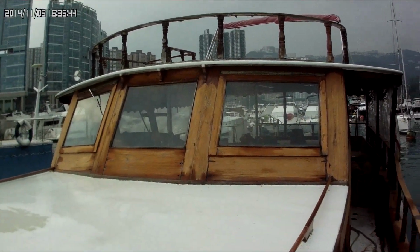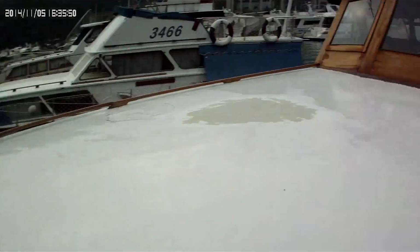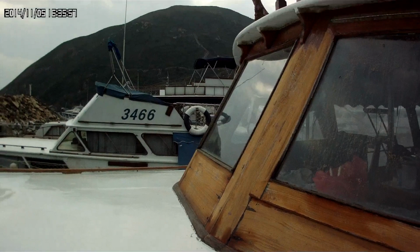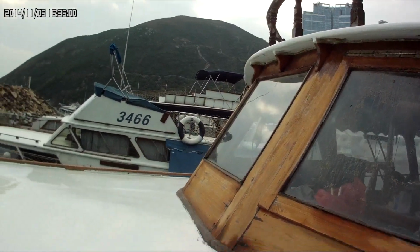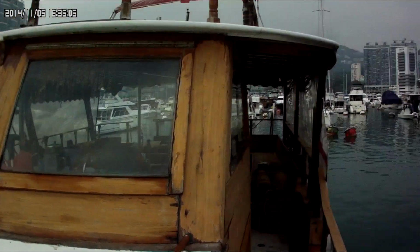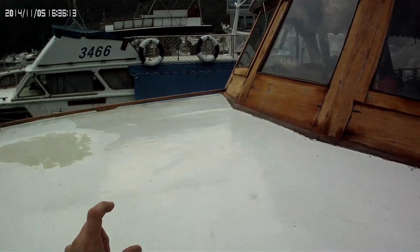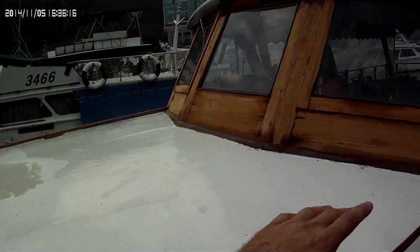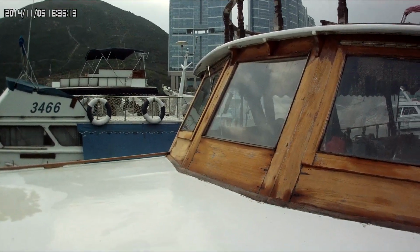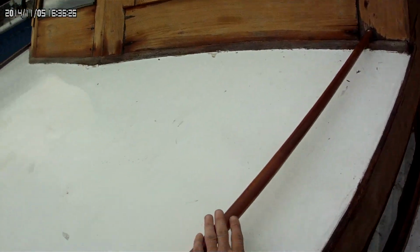I've got to get three coats. That's three days, so Friday, Saturday, Sunday. It's cutting it close, because the solar panels, I'll have to bring them over. They're going to be running pretty close, right up to here. So varnishing here is going to be a pain in the butt. We'll see. My goal is Sunday to have solar panels up, or at least here. Maybe if I don't attach them there, because I've got the feet for them, I can move them a little bit forward so I can step up so I can varnish. Because I've got to wet sand with 200, 220 grit in between every coat, so it looks nice and shiny and good.